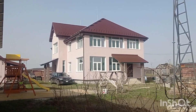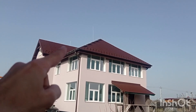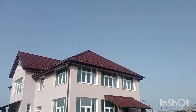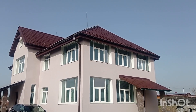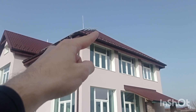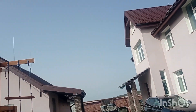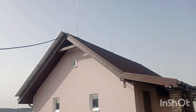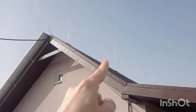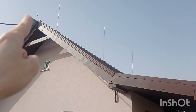On the house, you do it a little differently. You can see specifically two lightning rods here. They have to be connected to both the roof — which is metal in my case — and to the strings. Each string has to go to each corner angle, with small 30 cm connectors linking all the poles together.